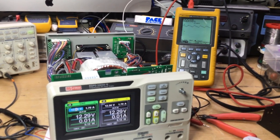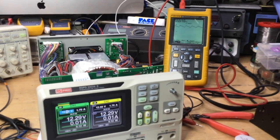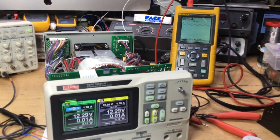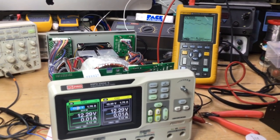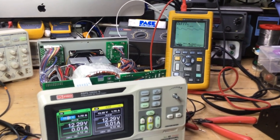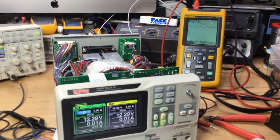And you'll see it try and recover itself as well. The output voltage from the bridge rectifier will come back once it gets down to about 5.5 volts, but it'll go off any second now, I think, once it gets down to about 5.5, and then it'll go off very shortly. It's dropping quick, 5.3, then up to 5.8, 5.7. You can see the waveform changing quite a lot. So it's struggling.